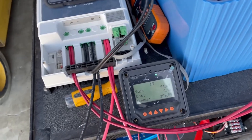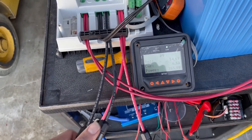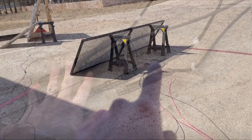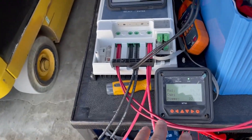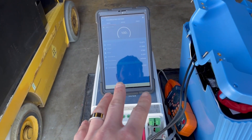The first and I think the obvious one that I didn't think about was resistance in the wires. Because when I ran this test before, I had the same 10 gauge wires going out to the panels, and then I just ran a branch connector to run in parallel. So I had double the current running through the wires when I was in parallel versus series, and that could be where I was losing about 10 watts — just as heat in those wires.